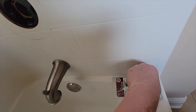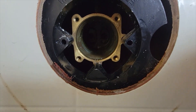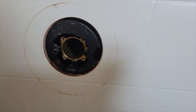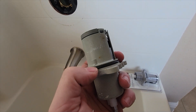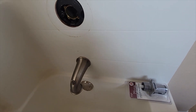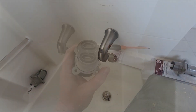Quick note: notice this area right here — this is where you fit a gasket. The new part comes with new gaskets. When you take it out, peer inside because the old gaskets may be stuck in there. I've got a little bit of water dripping so I need to make this as quick as possible to avoid water going behind the wall. You're better off using some form of synthetic grease to make it a little easier to install the replacement part.